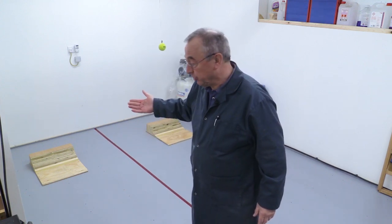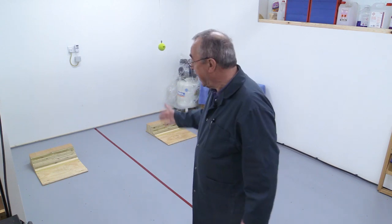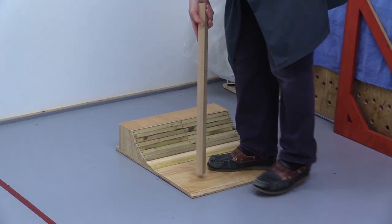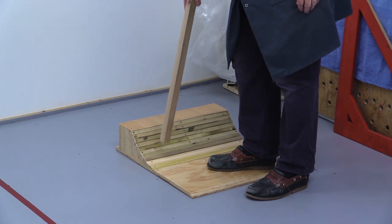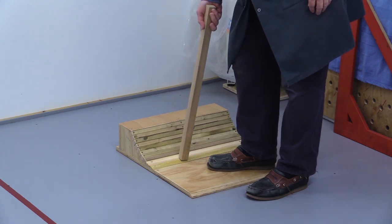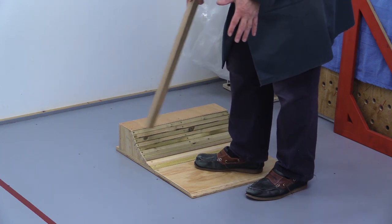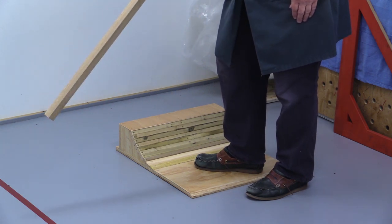But in this garage I've got drywall at the end and I really don't want to put any pressure on it at all. So I've come up with another scheme: a pair of chocks, and that's really what this video is about - how I went about making them. The car comes along, mounts this flat area, and then its wheel cannot go any further because it meets this chock piece here. That chock is the same radius as the car wheel, therefore it's a good fit, and having it the same radius means that with the weight of the wheel and the car going forward it's not putting any ridiculous strain on the construction. There are two of these, one on the right and one on the left.